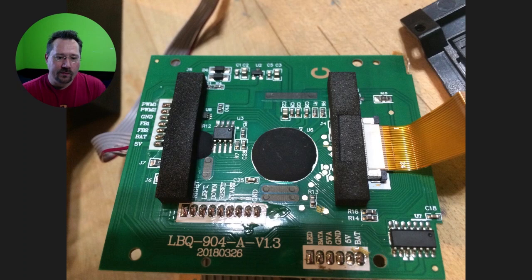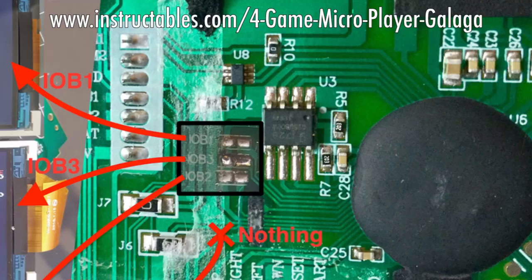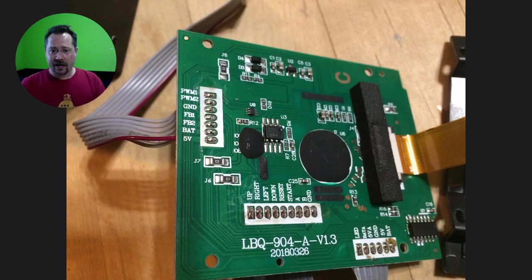What we're looking at here: under this is the main chip, but over here is the part we want to deal with. I pulled away this little piece of foam — basically just a spacer for the screen. But with it pulled away, we can see this other area that was potted. This is actually where there are jumpers which control which game gets loaded on startup. I found on instructables.com somebody had a nice how-to of exactly how to do this, but on his project there was not this black epoxy potting. So maybe the manufacturer put a couple of games on each of these cards and controls it with a jumper — but maybe they got wind that people were hacking their games and didn't want that, so they started adding the epoxy.